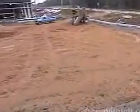One of the important factors with any of the concrete work is base material. You can see the type of gravel they put down compacted for below the curbing, and that will also take place over the whole parking lot area.